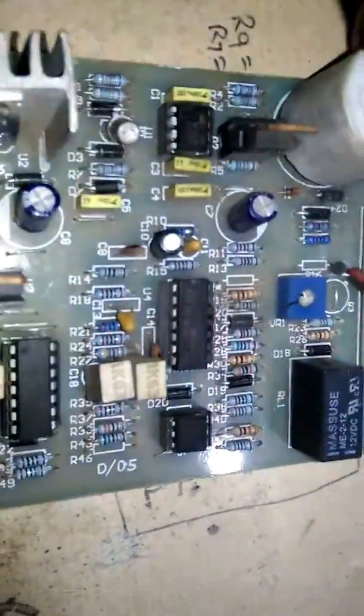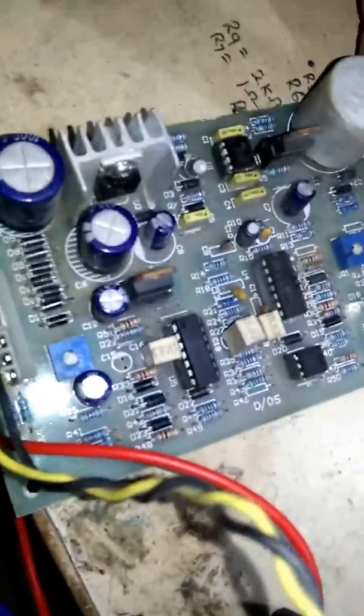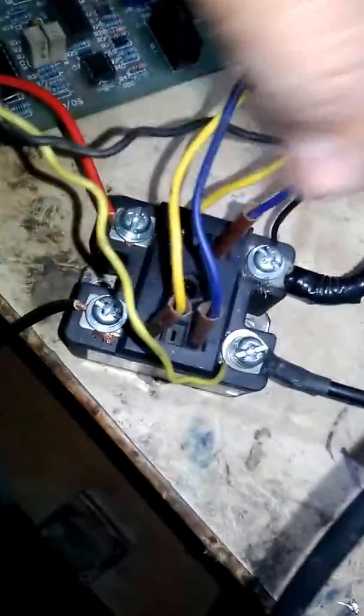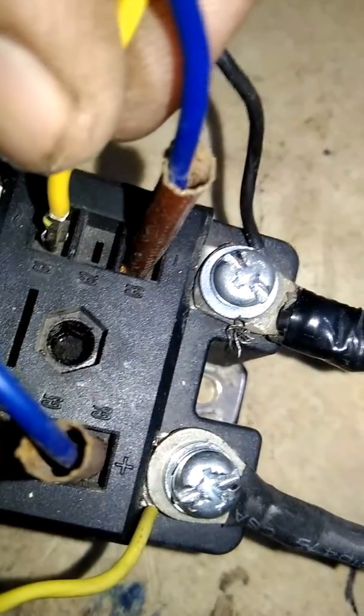You need to be very careful while doing this because it is very dangerous and you need a trained person with you. I want to show you the connection diagram. This connector — pins one and four are the positive and negative signal. You can see the connections: pin number one, gate one, gate two, empty, gate three. And from the second connector: gate four, gate five, gate six. These are the gate pulses.